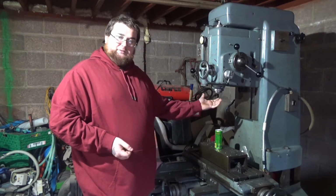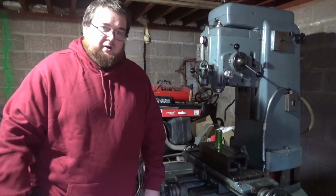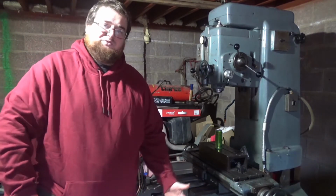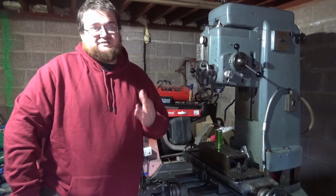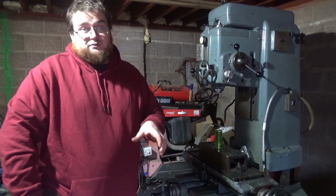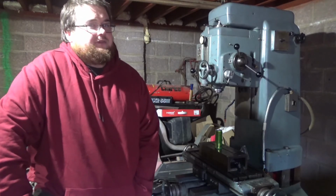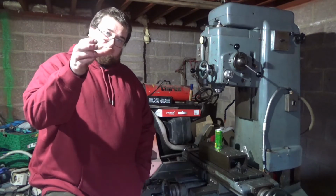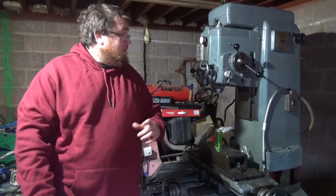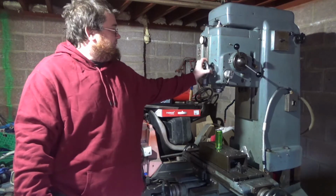It's a Morse Taper 2 spindle. Pluses and minuses. It's a plus because I've got a lot of Morse Taper 2 tooling for my 1ES mill. Minus, I would really like something sort of Morse Taper 3 or 4, particularly because I have a lot of tanged drills with integral tapers on them of 3, 4, 5. I only got a few of the 5s, I think, quite a few of the 4s, and quite a few 3s, but I do have some collars to step up and down. But Morse Taper 2 will do me fine. I will live with it.